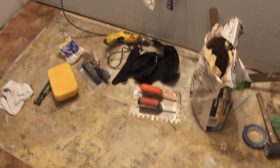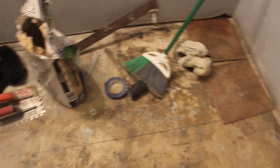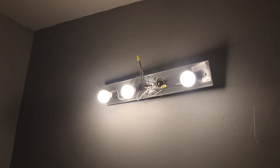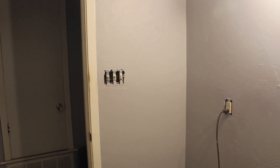Today's the 27th of April 2023, and that's about it for now. I haven't done the crown molding yet. When you get the tile done and grouted, the next thing will be to put in the base molding and the crown molding. We'll have to paint the trim, and after the base moldings we'll be able to put the vanity in, then finish off that fixture, and install the mirror and the electrical covers. So there's still quite a bit of stuff to do and I'll keep you posted on the progress.